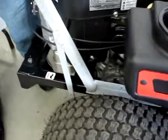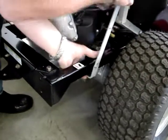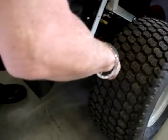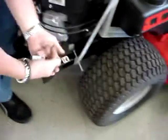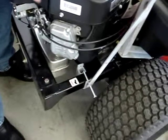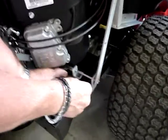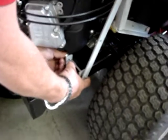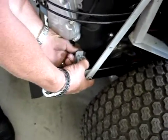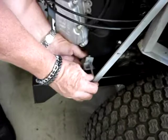The back end — the right-hand side and left-hand side are the same. To do the back part of this, you clamp over. Insert the bolt through the part into the U-clamp. We have a spacer that sits on the little ledge here, and that holds it together — you slip the bolt through it. The reason for the spacer is there are some frames out there that are wider than the frame they use today. Some old units have wider frames, and we have to accommodate it, so you have the spacer there. Tighten up these bolts and it's in place.